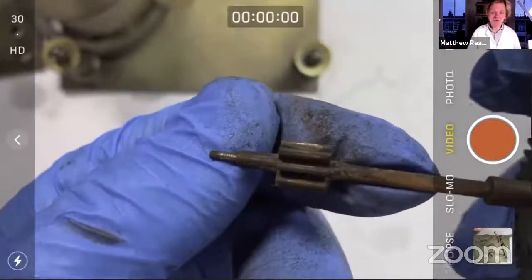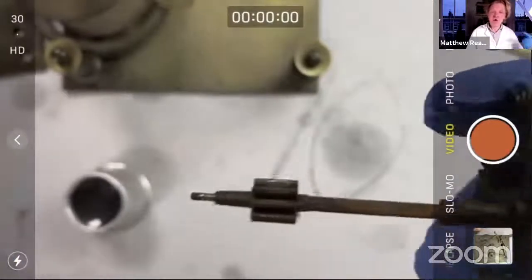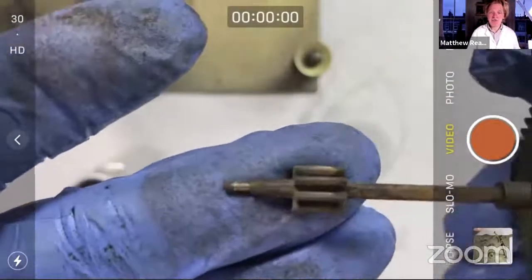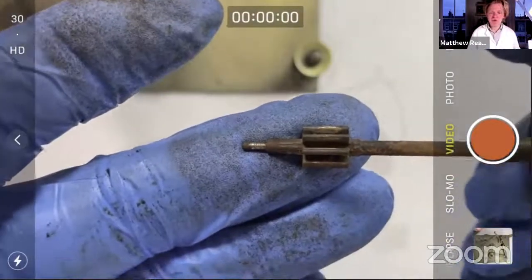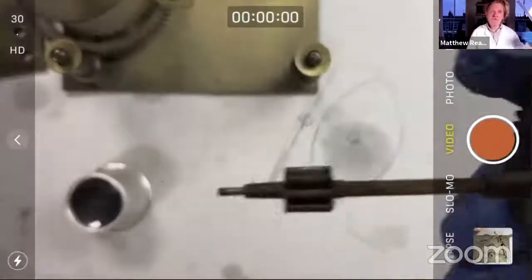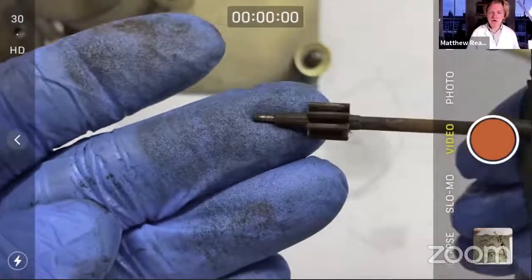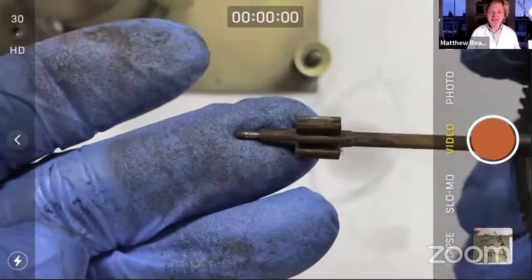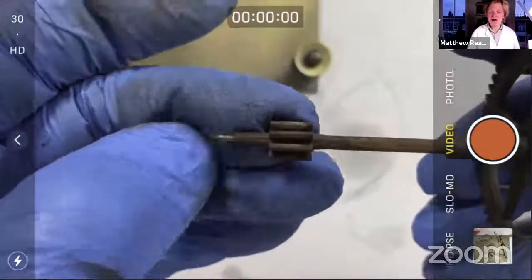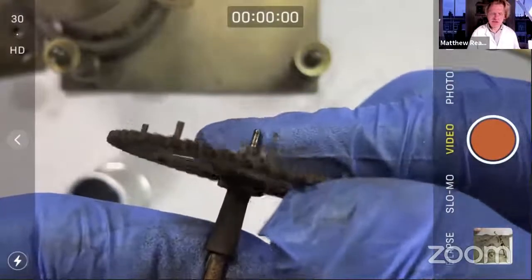Once it is clean, get rid of the rust, clean up the bearing hole. Those marks have been caused because of a failing of lubrication or contamination, probably rust by the look of it, and the clock continues to run. Once it's all cleaned out, those marks are going round with the pivot. They're running along the pivot. As much as there are no guarantees in life, I guarantee you this clock is going to run absolutely fine with that pivot just getting a bit of the rust off, and the same for this end as well, which isn't as scored.